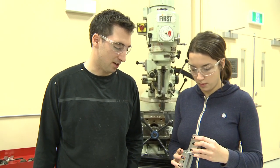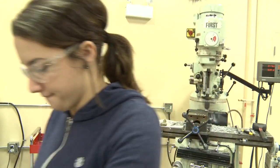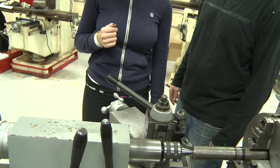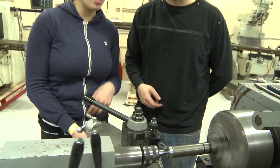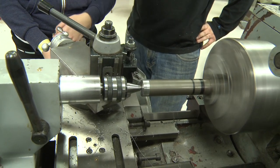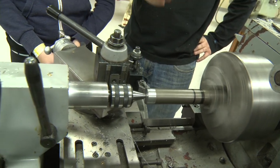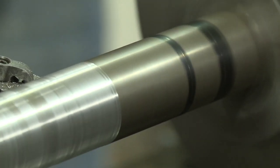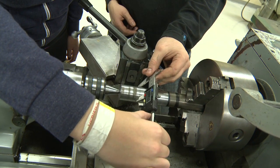There's one more step — slides right in there. Look at that, perfect. This is a different metal — this is steel, so it's going to be a little harder to cut. Smoke coming off it, pretty crazy, it stinks. It's shaving stuff off the outside, and it's making the part concentric, so now it should be a perfect circle. Pretty cool. Where's it supposed to fit? In the bottom — so you have to take a lot off. We still got quite a bit to go.